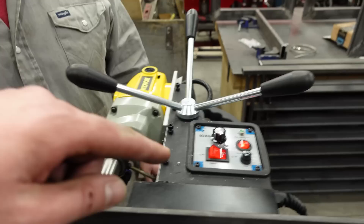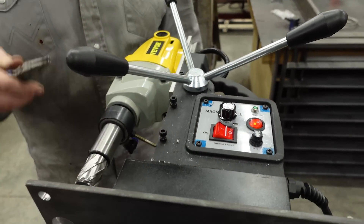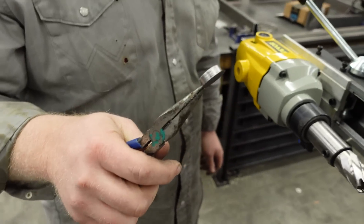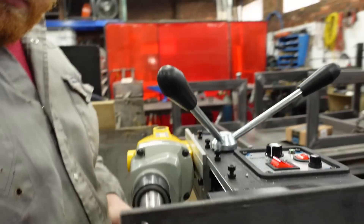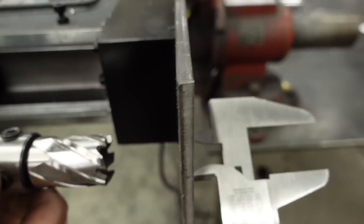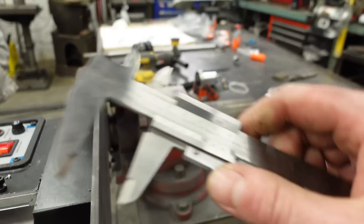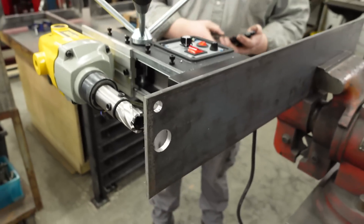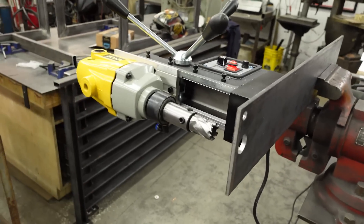I wonder if while the drill is on, it would be smart if it nullifies this magnet-off switch. And that's your plug — that's all the material it didn't have to cut in order to make this beautiful hole. I wonder if these holes have any overlap in inches. This is allegedly a 26 mil — measuring at 1.025 inches, about 1.024. Oh, that's acceptable. Cool.